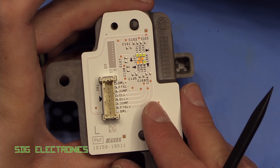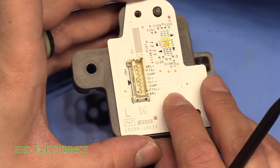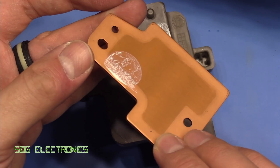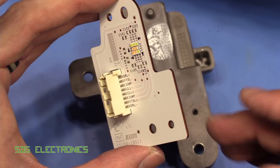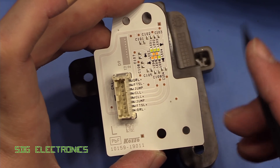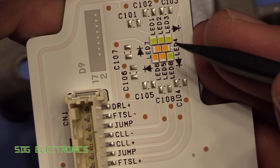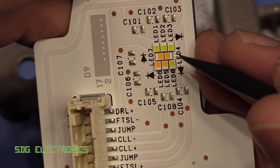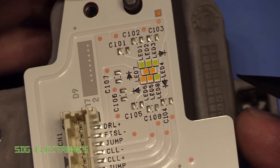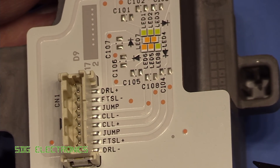Here's the other LED unit from the other end of the light pipe. Interestingly, this one is mounted on a really quite chunky heat sink — the whole assembly is quite heavy. The PCB is one of these copper PCBs, which are also really quite expensive. You've probably seen aluminium-backed PCBs for the old Luxeon star type LEDs. Because the LED density is quite tight here, there's no place for thermal vias to conduct heat away from the LED, so they've obviously had to mount this on a piece of copper to get the thermal performance and prevent the LEDs from overheating. No capacitors have been fitted — it's just the LEDs and the connector to the driver unit.